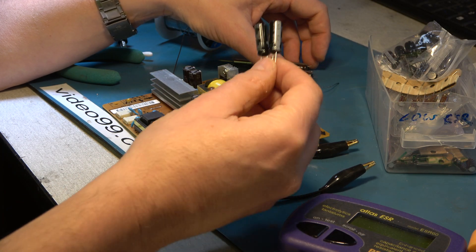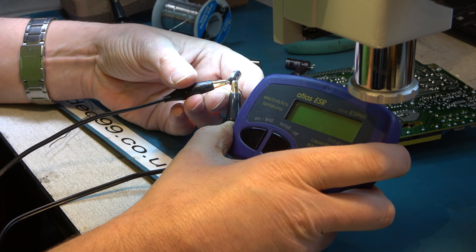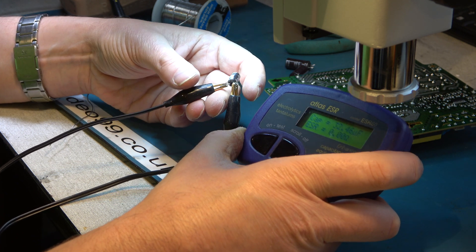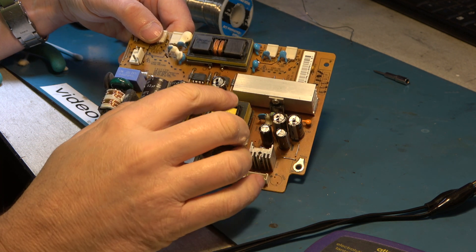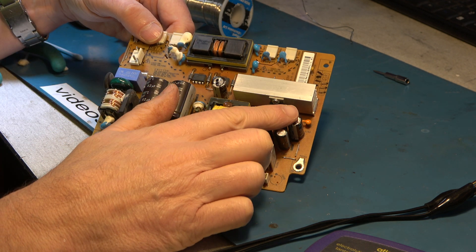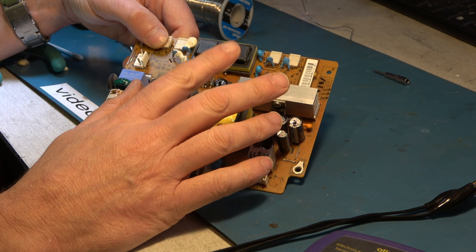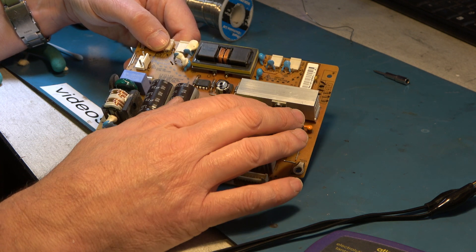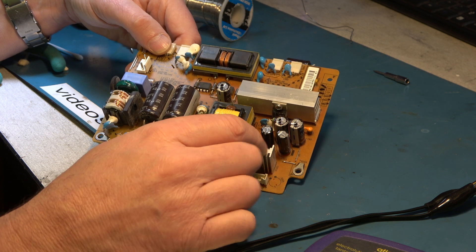The original components are rated at 105 Celsius, and so are my replacements, but these are low ESR types as well. The one that was covered in sealant is supposed to be 33 microfarad 50 volt — it's measuring nicely. I don't have one to hand in 105 Celsius, so I'll have to refit that one for now. Ideally I'd have replaced all the capacitors, but I don't have some of these values to hand. I'm satisfied that the three 1000 microfarad 25 volt capacitors are actually good — as good as new — and that 33 microfarad one too. It was just the 1000 microfarad 16 volt capacitors that were the trouble.